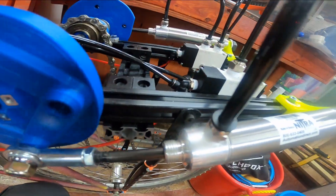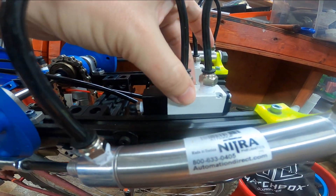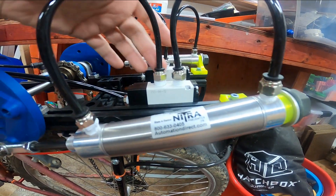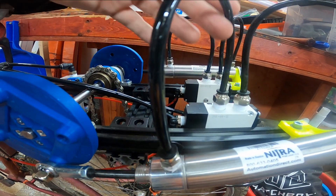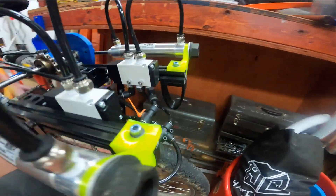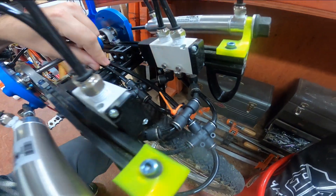This is the pilot that's running off of here, shuffling a cylinder inside here back and forth, powering this side. Pressure in here and exhaust out here. And then when this loses power, a spring pops it back, putting pressure to here and exhausting out this side. Exhaust is the front and rear — we collect both of those again, as you can see there and there.